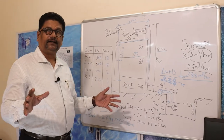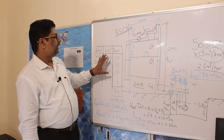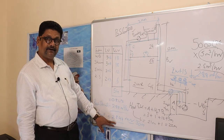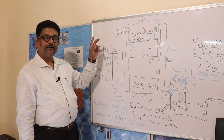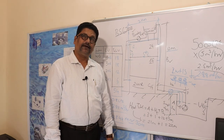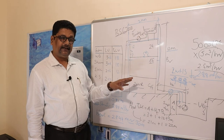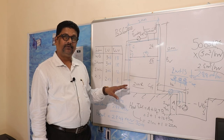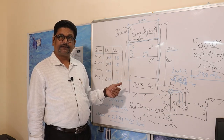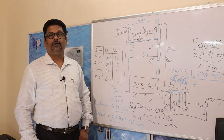To summarize: we covered how to calculate peak demand for a booster pump — taking loading units from BS 6700, calculating total loading units, converting to LPS and meter cube per hour, finding friction loss, and arriving at the pump head. I hope next time you will use all this to arrive at the right booster pump for your application. My next video will cover sewage applications, so stay tuned. Please like, comment, and subscribe. This is Balaji Ganesh signing off from pumpexpert.com.